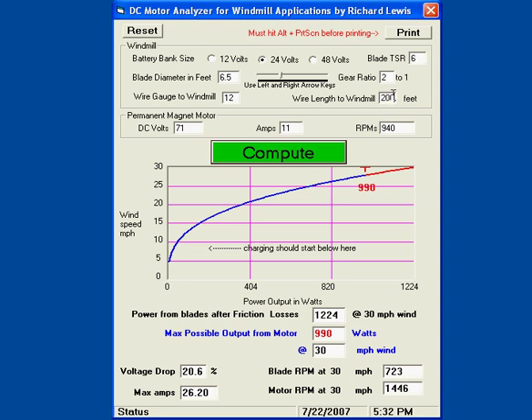Let's say I went 200 feet — that's overkill. I'm at 82.5% voltage drop, so we definitely wouldn't want to do that with 12 gauge wire. But we could go 200 feet at 4 gauge — much better, actually tolerable. That's into 24 volts. The typical run though is 50 to 100 feet, and maybe 6 to 8 gauge wire.